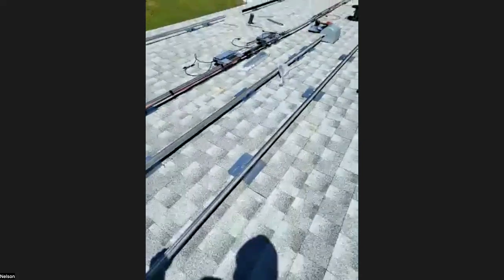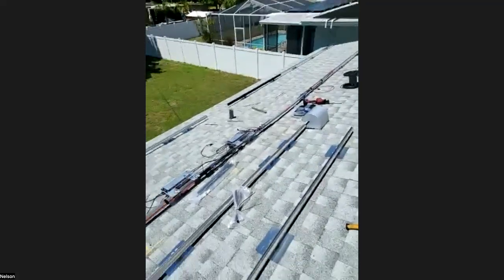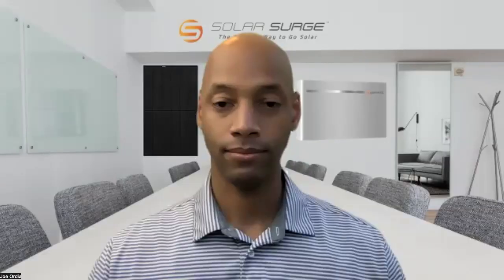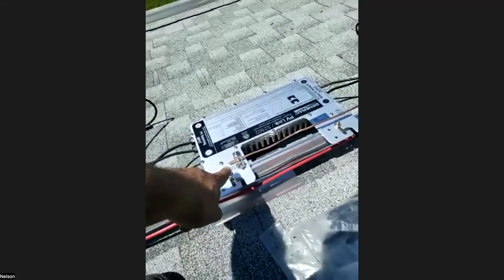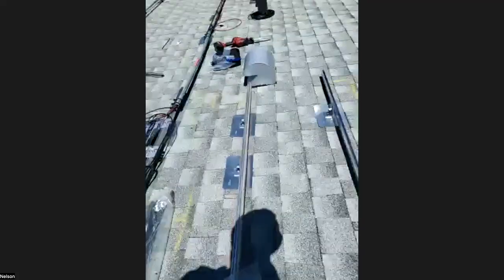Someone throw me a harness. All right, I'm anchored in. Let me see if I can turn this camera around. So we have Iron Ridge Rail going in. This is a 9-kilowatt system; the solar panels are 415 watts, so that's going to require three PV links. It goes by voltage, but an easy way to remember is never exceed 2,500 watts — that's an easy way for us to map out our strings. Very important: the PV link needs to be grounded. A lot of people just ground the rails, but when installing Generac, I highly recommend grounding the PV link as well to the system. It actually requires that.